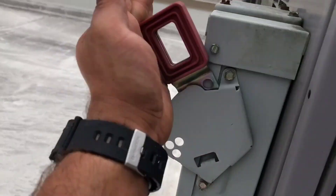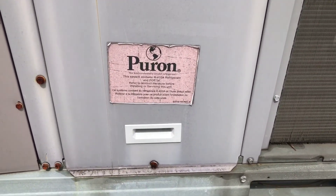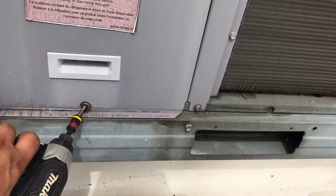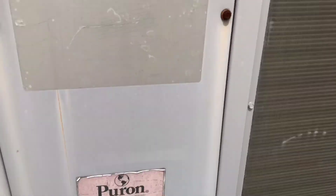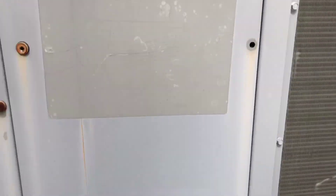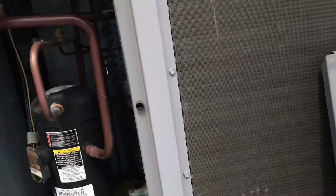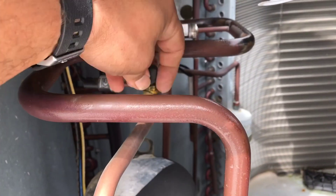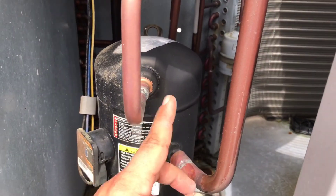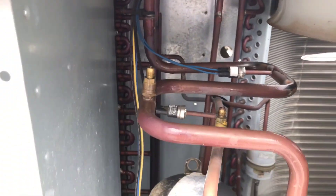This thing kicked on. While we're waiting on it to kick back on, we're gonna go ahead and take this door off — this is where you get to the compressor. The service port should be right behind this door. That's gonna be your high-side hookup right here, and then this one — just follow it back to see your suction and head pressure. Follow the suction line and liquid line back to your port. Let's get our gauges on it.